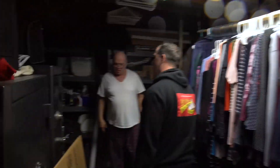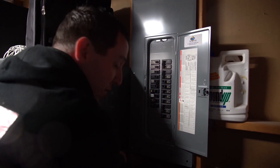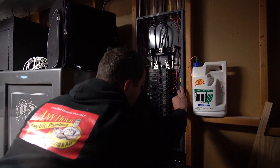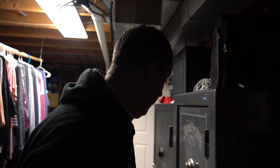The panel's right there, okay. I'll just take a quick look at this and then come up and write you up some options. Right now we're just going to take a look at the panel and make sure everything's safe. I like to do a little tug test on the breakers first, make sure none of them come out. This doesn't look like a really good panel.